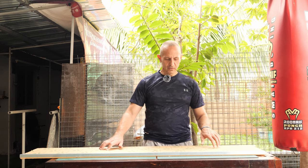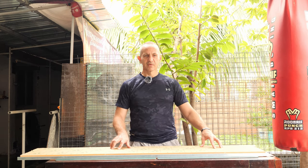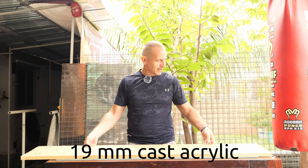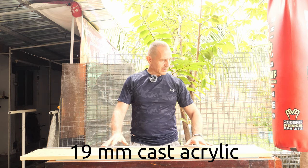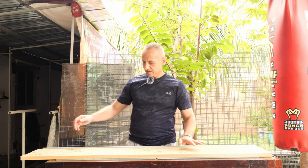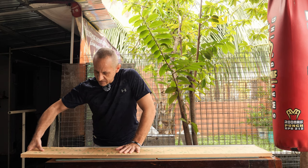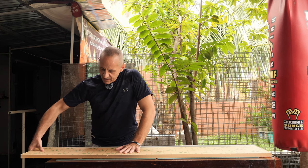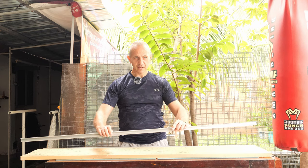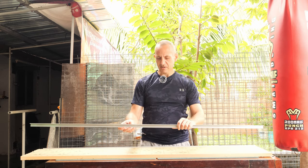It's a good idea to choose plastic and aluminum as a material for your jigs. So this is why I have decided to go for the cast acrylic — even though it's very flat and pretty stiff, as you can see with some reasonable force I can still flex it. I'm going to make it more stiff by using this aluminum angle profile which is three millimeters thick.